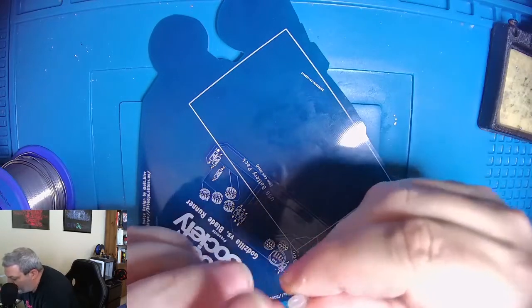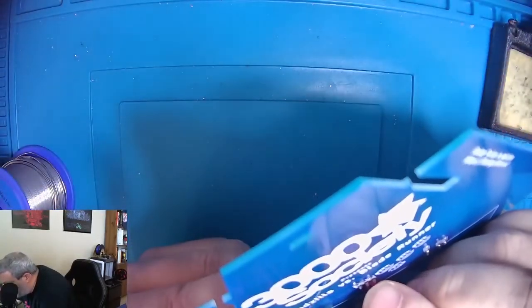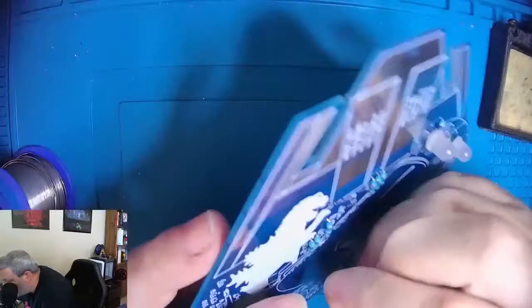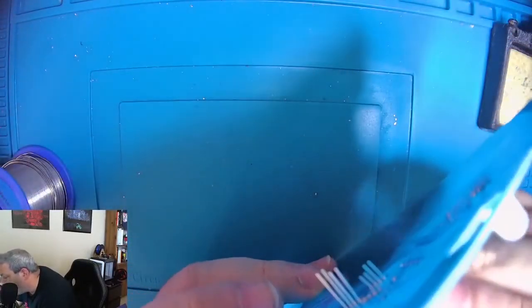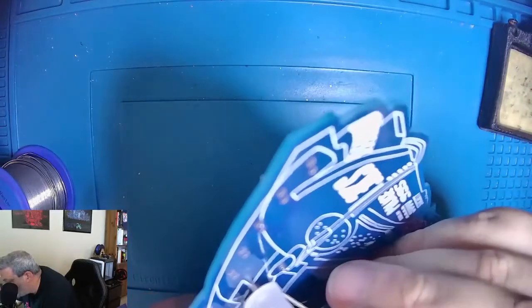And these are the smaller LEDs, and they're similar in that some of the pins are higher, and the higher pins correspond with the flat edge. And so when we look on the back, we can see that the flat edge here is going one direction, and the flat edge here is going the other. Same here, so they're popping opposite directions. So that means we'll want to put the one on top going out this direction. And then this one we're going to put going the opposite direction. We can go ahead and get the other two in for this side. And we'll solder all four of these at once.